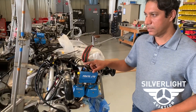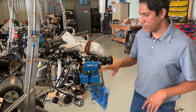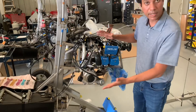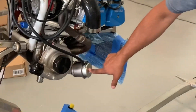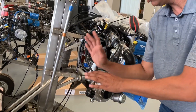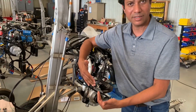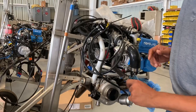This is one of the 915s we recently just started the engine installation on. This COVID-19 situation, the engine and everything is coming slightly late, but things are getting back to normal. You can see this is how the engine comes from the factory, and you can see which way the turbo is clocked here, and where the servo control is right there. Turbo is clocked this way, and usually they put out an intercooler that kind of sticks out here like a sore thumb, so the intercooler will be sticking outside of the body looking strange. I didn't like that, so we changed it — we re-clocked the turbo and everything, and we can see that on the other one.